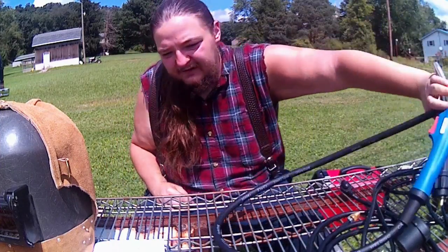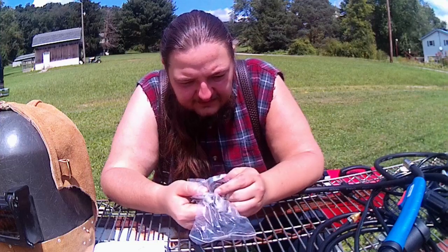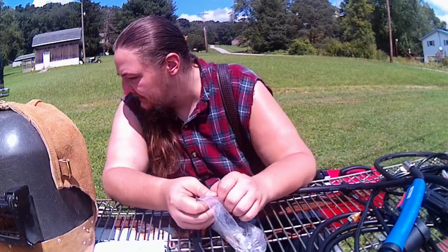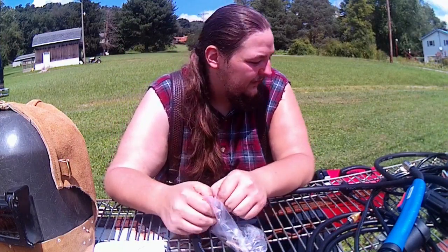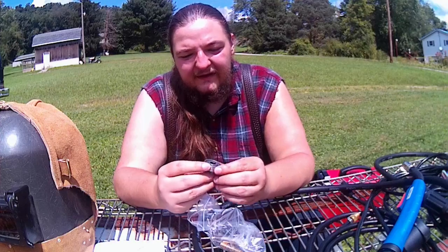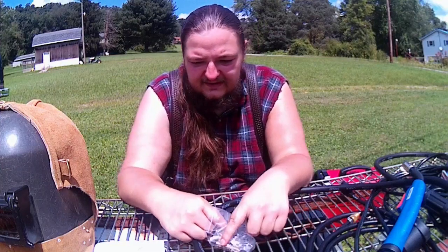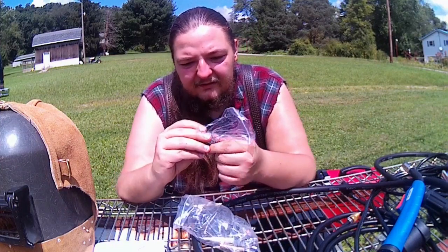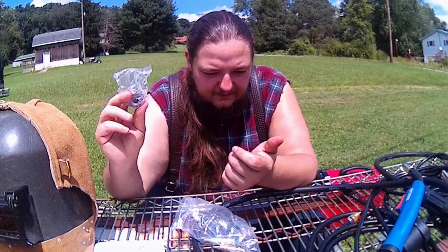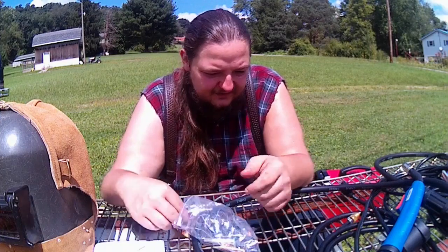We do have a bunch of drive rollers, which again are in metric sizes. Oh wait, hold on. Actually no, they came with regular sizes for us here in America, which is nice. Again, like I said, compared to the reviews I've seen, they have really stepped up the game. So they do have the .030 labeled on our drive rollers here, which is nice. Yep, same thing here. These are the knurled ones for flux core, .030, .035. Okay, so this knurled one here is in metric, I mean.